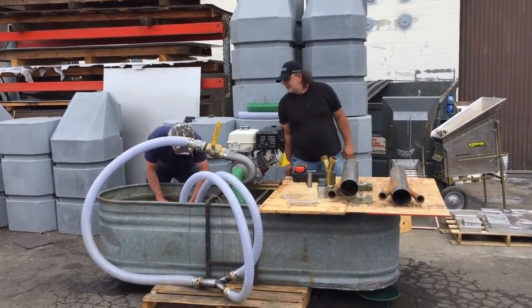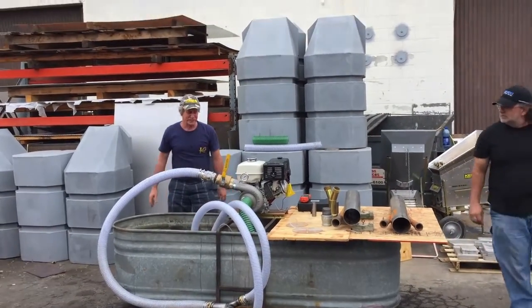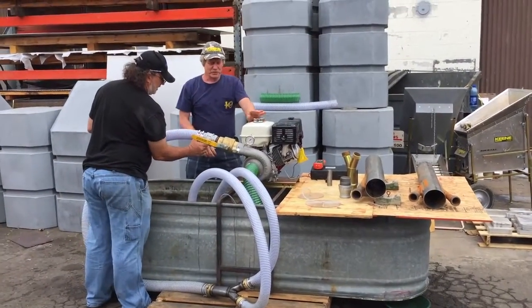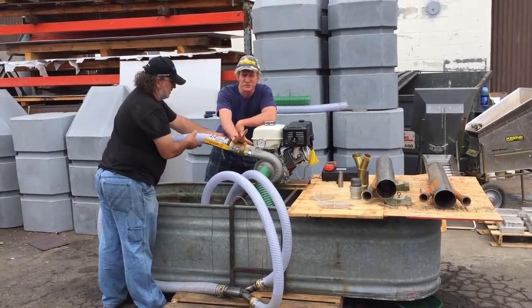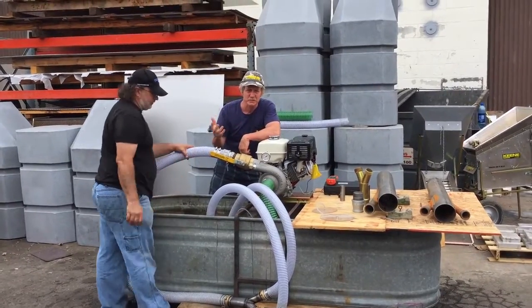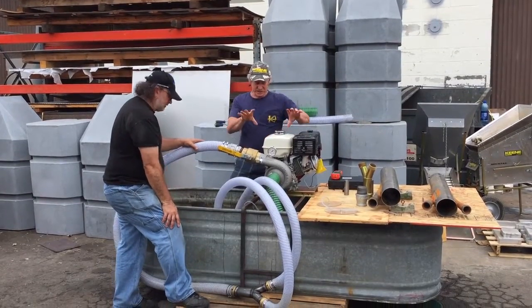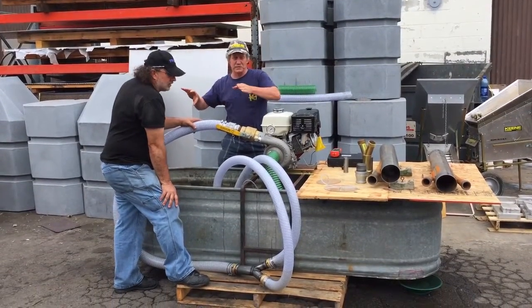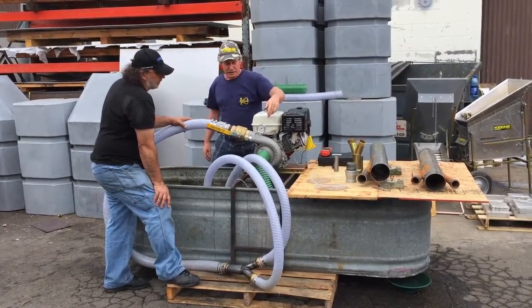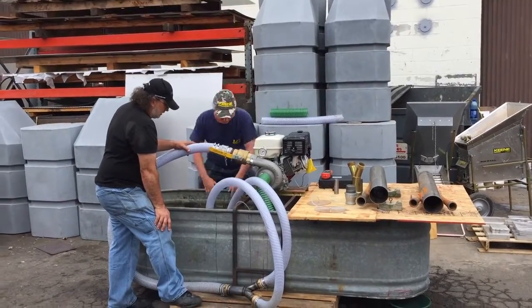Alright, we've got to prime this thing now. Whenever you prime one of these pumps, you've got to remember that normally you have a garden hose port that you can loosen up. Since we don't have a garden hose port here, we're just going to crack this loop so the air can get released when we prime it. Inside your foot valve you have a one-way check valve, so every time you thrust it through the water, the water climbs in the hose. You pull it back and thrust it forward, and the water continues to climb higher and higher until you have water all the way to the pump. It's a big pump, so it takes a little work to prime it manually.